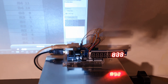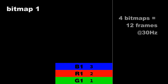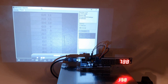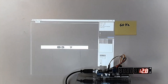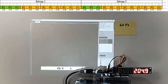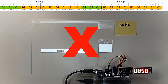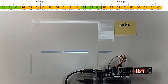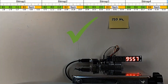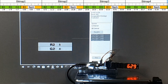To understand the frame sequence of our projector, I used my Arduino Uno as a millisecond clock and created a bitmap player on a connected PC that provides a sequence of four test bitmaps, so I can analyze the sequence in slow motion. From the standard 60Hz input, the projector displays color subframes in BRG order, and a standard 60Hz input image would be repeated four times. This repetition is not good for our purpose — a repeating frame would end up twice at two vertical positions on our volume. The 120Hz frame sequential mode looks much better and has almost no double frames at all. However, we need to block out the second part of the sequence, which contains the so-called DLP flash that we want to get rid of.